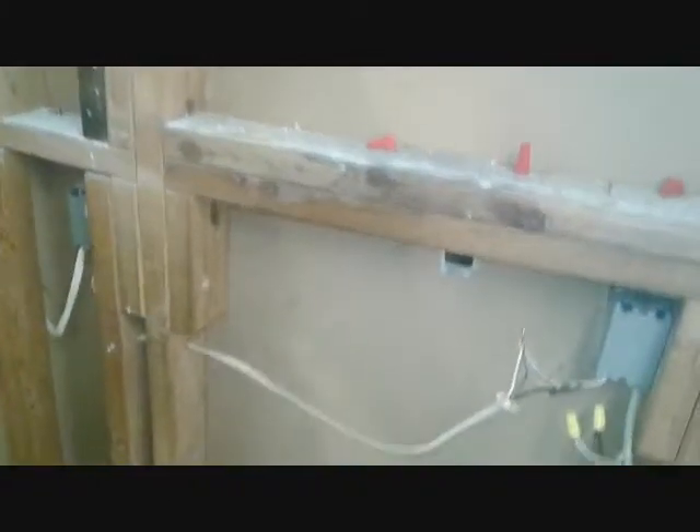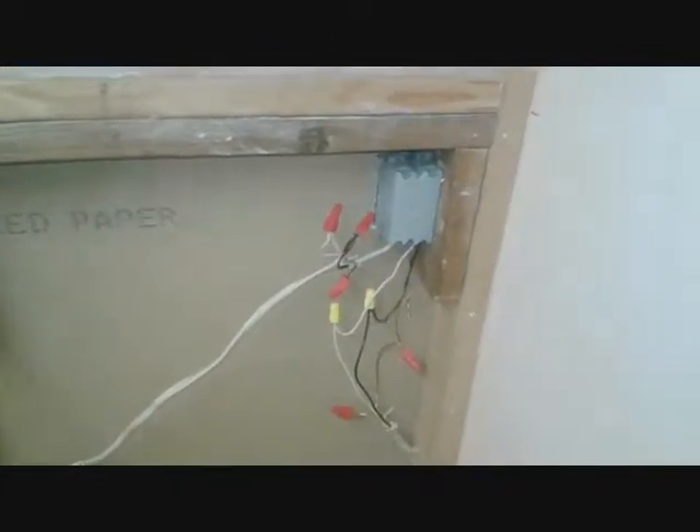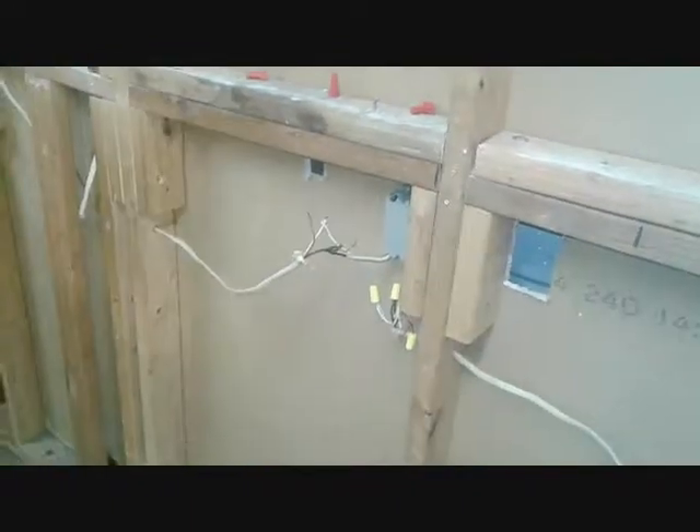I mean, other than it's all wrong — well, it's connected. With wiring you only have a ground, neutral, and a hot. The problem is I believe one of the sockets blew, and the way this is wired, it goes from one socket to the next socket, so if one socket blows, the rest of the whole line blows. That's the wrong way to do it. The right way is to pigtail all your sockets, so if one blows, the rest of the line will still work.